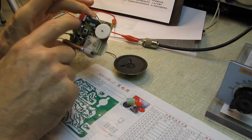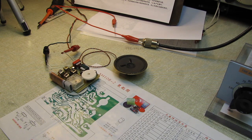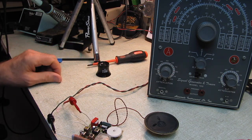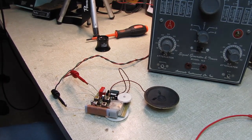From at least this point forward we're working. Now where is V2? I'm hearing noise through there, but not a lot — that's not surprising; we're going through several stages of IF and nothing's been aligned yet. Let me hook up a signal generator and see if we can detect anything coming out of the mixer stage. I was about to inject some 465 kilohertz into the IF strip to see if we merely had a bad case of misalignment.